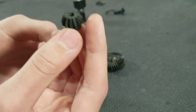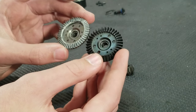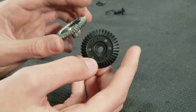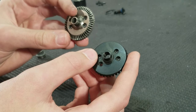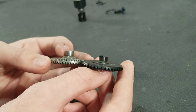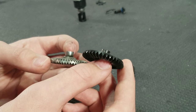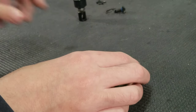I hope that these are as good as they look. If we compare the ring gears, there's not that much of a difference in the center portion where the diff cup is, but on the back this one is a little bit more flat than the stock one. Another good design choice on the new ring gear is that they got rid of this little bump right here, so that they could make the teeth bigger on the new one. Alright, let's stop talking about these and start installing the new spiral cuts.